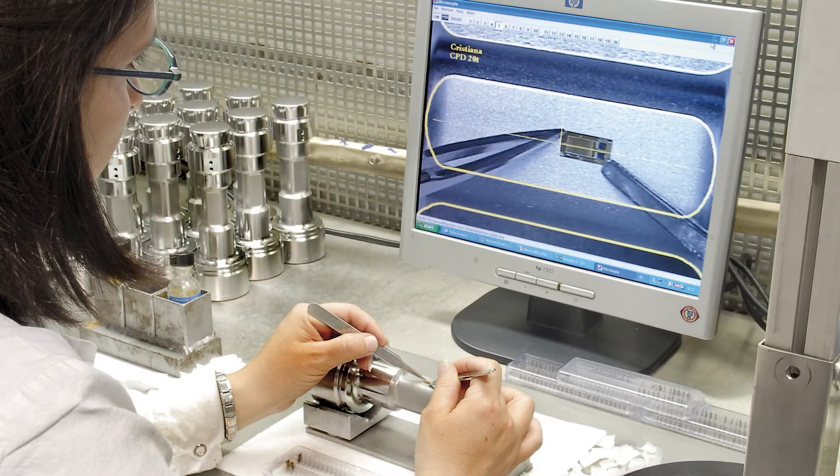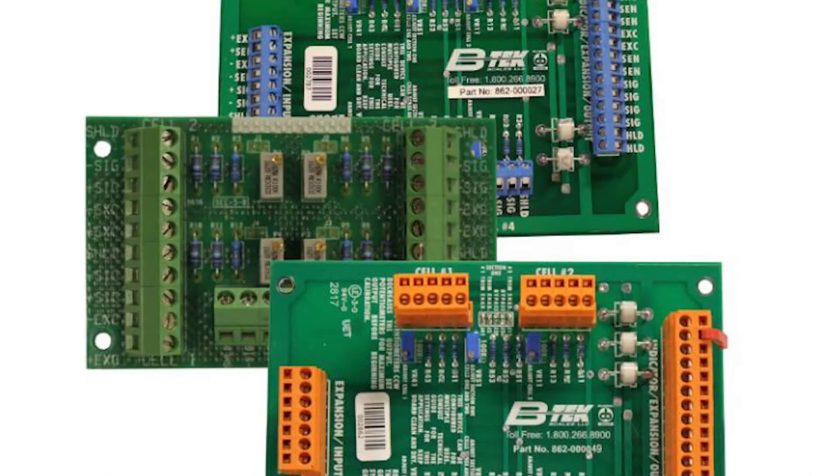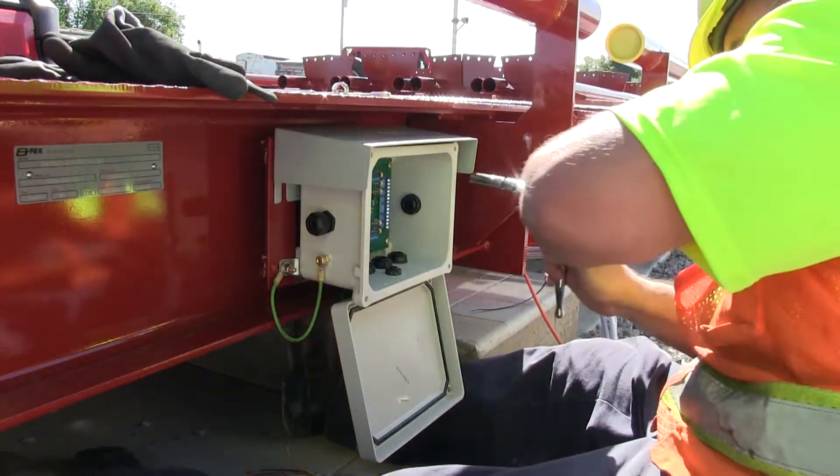The rate of change can be calibrated or adjusted through a summing card or an indicator, depending on the cells you have and the type of weighing system in place. The CPRM Analog Load Cells are calibrated cell by cell at the summing card where all the load cells connect.